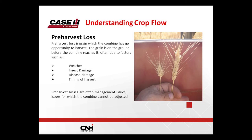Other things to look for: sometimes weather is not nice to you and can affect your crop. Insects can affect it as well, and disease. Timing of harvest matters too. Here's a picture showing two heads of wheat — one is a lot harder to thrash than the other. You may end up with unthrashed heads in the grain tank and fight yourself trying to get them out. You may not be able to adjust the combine to thrash the diseased head properly, but that's not the combine's fault — it was disease in the crop.